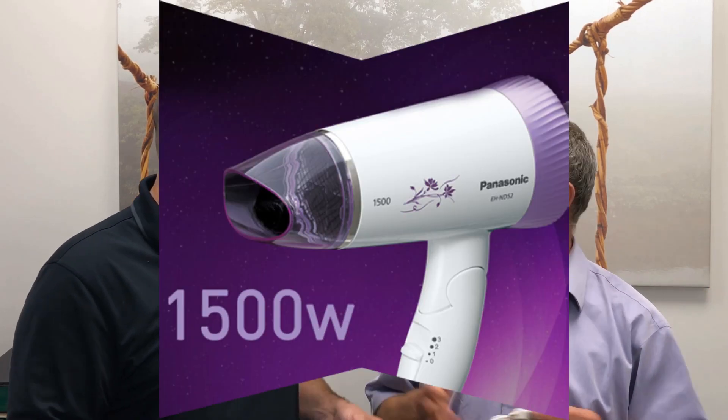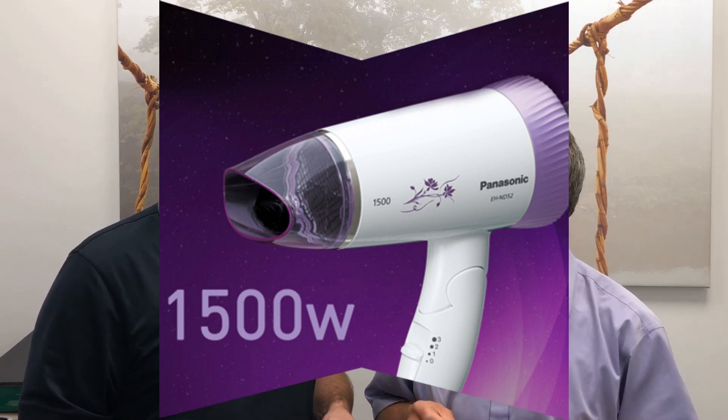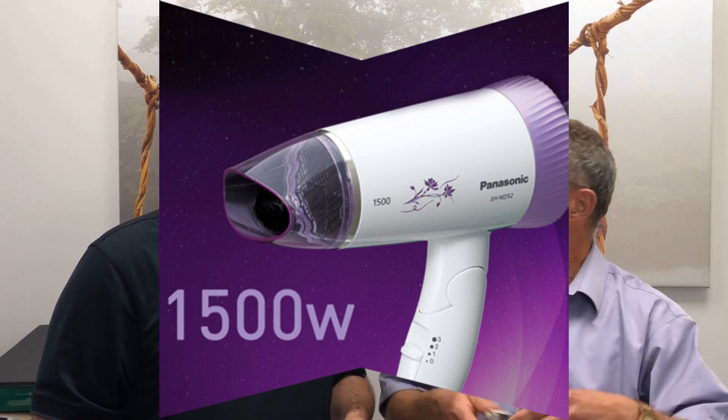My air conditioner pulls a lot of power too. Even your hair dryer — a hair dryer draws 1,500 watts, which is a lot of electricity, basically one full breaker. And if that load is passing through a backstabbed connection and you have something else running at the same time, you're taxing your system right to the limit.